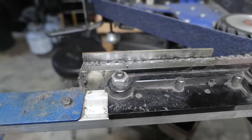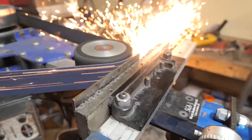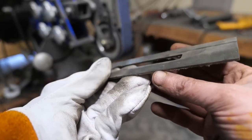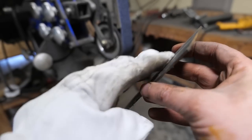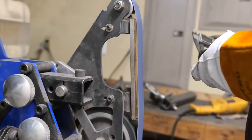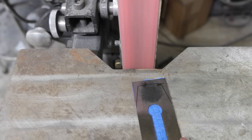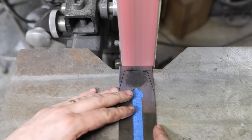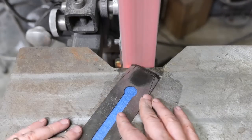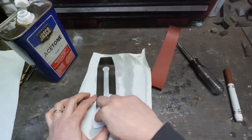My surface grinder does not make things perfectly flat — in a lot of ways it messes that up — but I've got a lot of material to remove and the easiest way to do that is on the surface grinder. So I went ahead and threw it on there, got it down closer to the final specification, and then I finished the flattening process very carefully on the ceramic platen by hand. Lots of hand sanding later, this looks a lot better. We're going to get it cleaned up with some acetone and into the etch.